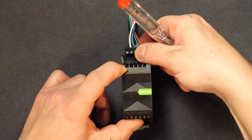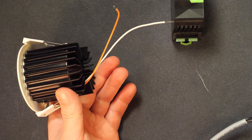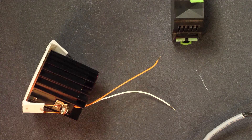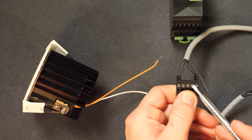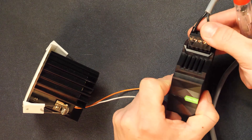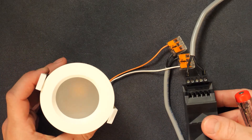If we use it now for a 3000 Kelvin 24-volt spot — there's a slimmer version of this as well, 5 watts or 8 watts — or it could be a single-color LED strip. Then we need just one channel. The wiring order runs the other way from how you'd read it, and we need to remember the minus is this one here. That's how we wire the first circuit.